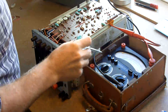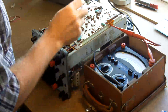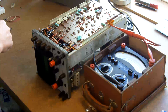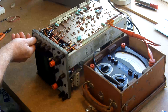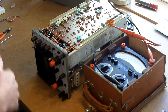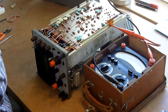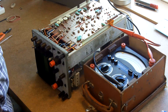I've got the EVO onto the AC range — 3000 volts AC — and I'm looking at the output of that rectifier. What I'm getting is 1300 volts AC out of the rectifier, and that ought to be DC. So I think that rectifier is nothing more than a glorified resistor.